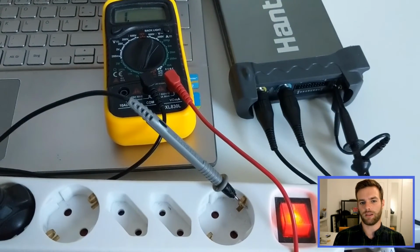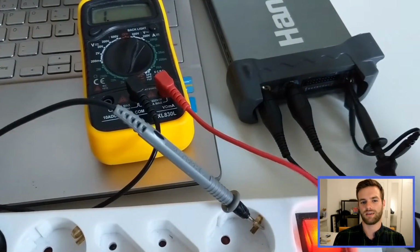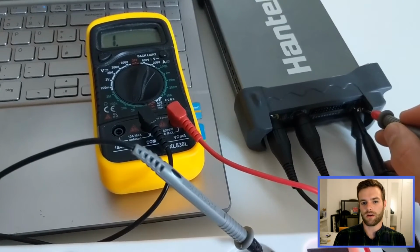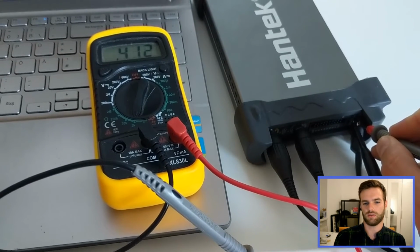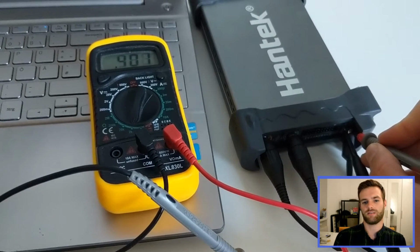Connecting the alligator clip of the oscilloscope is effectively the same as connecting a 500 ohm resistor to the earth mains. If we happen to connect the clip to a source capable of providing a lot of current, all this current will flow through this virtual 500 ohm resistor and effectively burn our computer. As long as we keep this in mind, we should be fine.